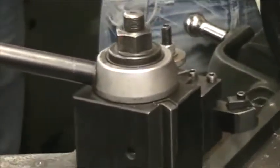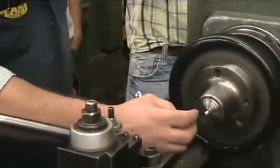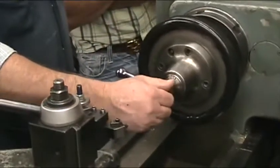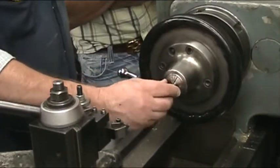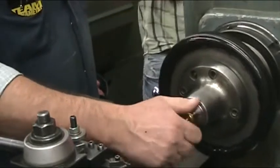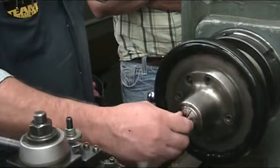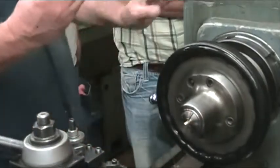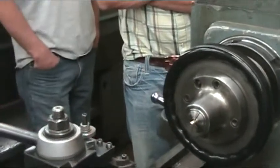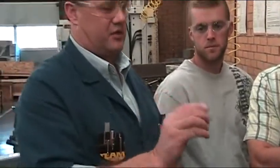And I'm just going to try with this wheel and see what I measure. Now, if the wheel will screw on, I'm going to measure it with the thread wires. If it won't, it's because this thread could have been cut too big on the wheel with the tap. And in fact, it probably was. That's still snug right there. It's pretty tight. That is one wobbly wheel. Somebody either drilled with their center drill off center or just kept drilling without center drilling it.